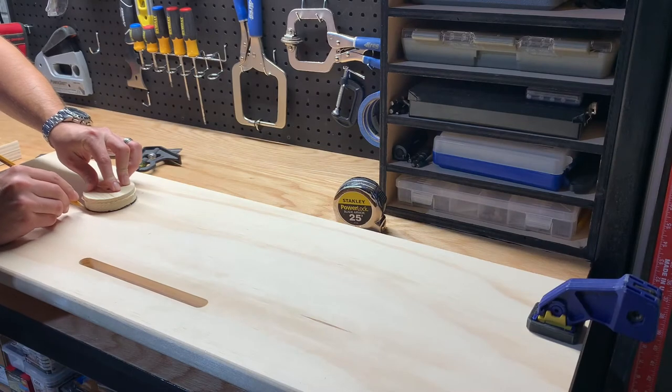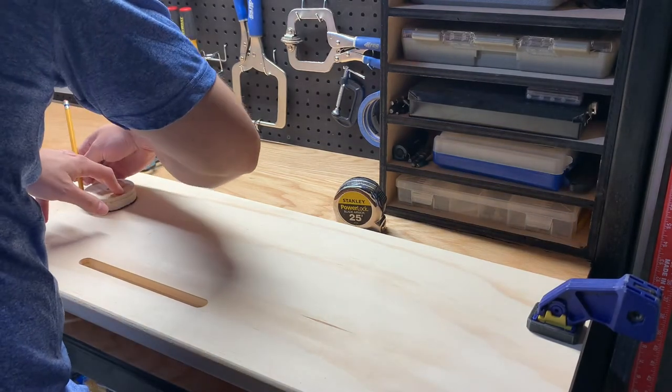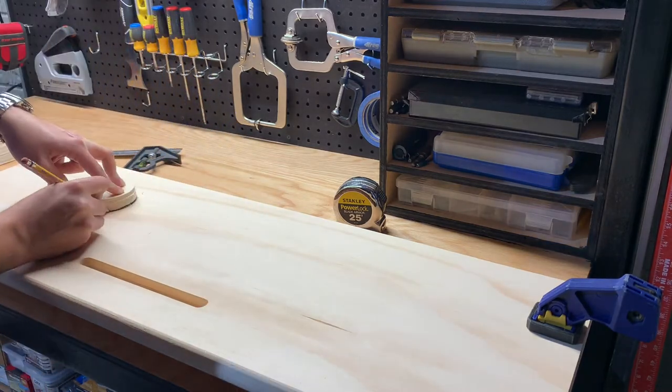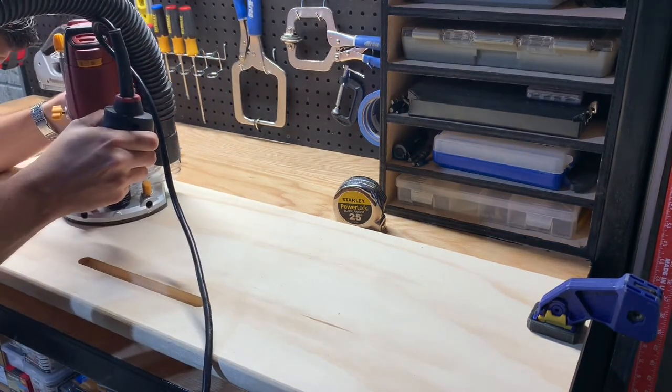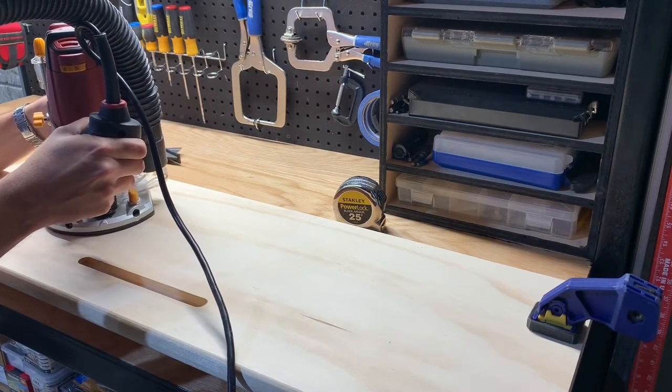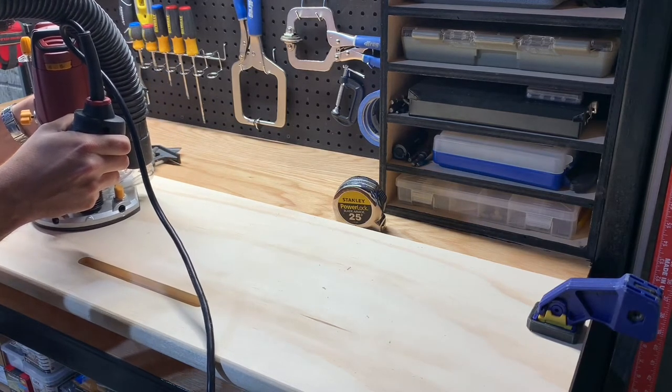I checked the glasses being used for drinks and tested that they would fit in a three-inch hole. I used my three-inch hole saw on a piece of scrap lumber and drew a circle around it. I set the router at three-sixteenths of an inch deep and carefully free-handed the circle, focusing on the outside first and then clearing out the middle.